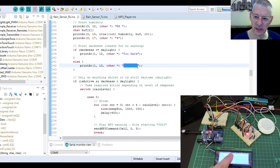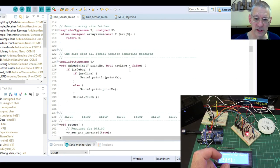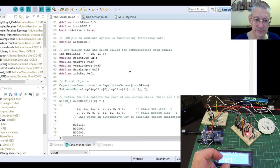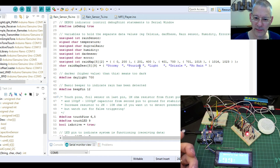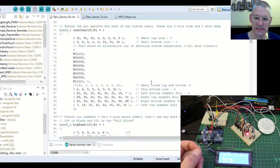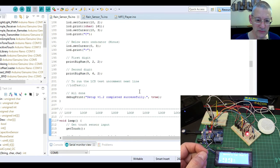You have to be careful about clearing text on LCD displays — unless you actually clear what's on the screen nothing will clear it for you. You could end up with leftover characters if you print short strings after long ones. That's also why all the rain descriptions — stormy, pouring, light drizzle, no rain — all have to be the same length with padding spaces at the back.